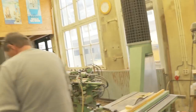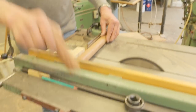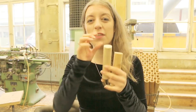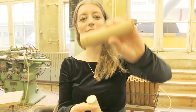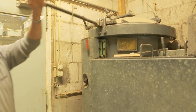So now these cylinders of wood are going to be sawn into head joints. We now have a stick of wood and this is going to become the head joint of a recorder. We're actually going to boil this in paraffin — this is to make sure that the density of the wood is the same all the way through and it makes the wood a lot easier to work with. This one has not been boiled in paraffin and this one has, and this one is much heavier. After 24 hours in the paraffin vat, the wood is ready to be drilled.